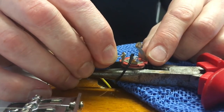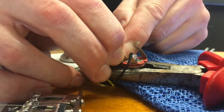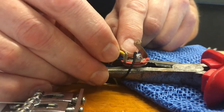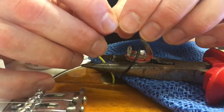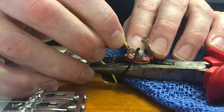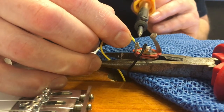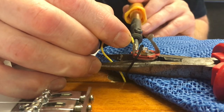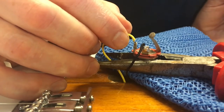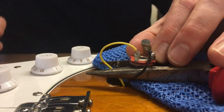Put the wire through the hole and just hold it there. If you desire you can get a little bit of a twist on it so that the wire is secure. You can hold the plastic piece with your hand and just bend that around a little bit so that the wire is now secure mechanically. Then we're going to apply a little bit of heat with the soldering iron. And there we have it - the wire is now reconnected.